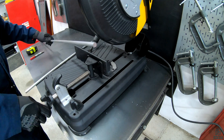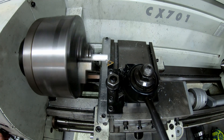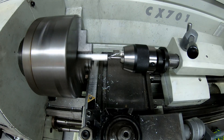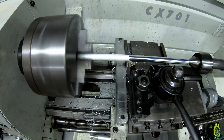I also quickly roughed out the drive shafts — first cutting sections on the chop saw out of half inch aluminum rod and then turning them to size on the lathe, by first facing then center drilling for the live center before taking them to final diameter. I needed these shafts to make sure that the chassis was aligned before welding.